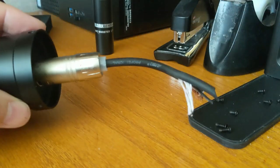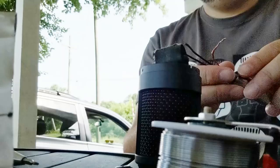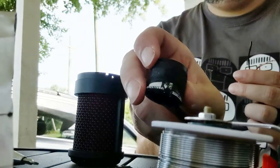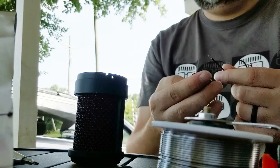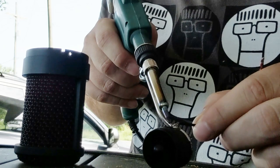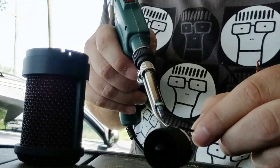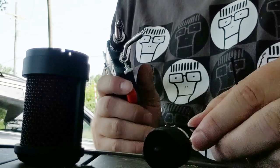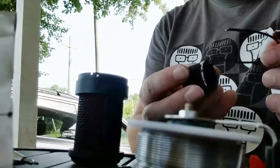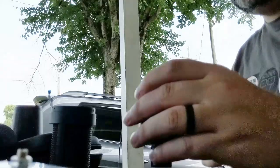We click the XLR into the mic booster — it had the female end already — and make sure we've got enough room for everything plus the capsule. Now we get to soldering. This right here is going to be the hot. I'm using a PVM 44 capsule — it was on the Q8 — and I'm going to solder this XLR connection to this capsule. It sounds good enough and it's one of the mics I've had a hard time selling. Then we do the other wire — the non-hot wire — soldering that into the other side of the capsule. Pretty easy once you grab a soldering gun and just go for it.